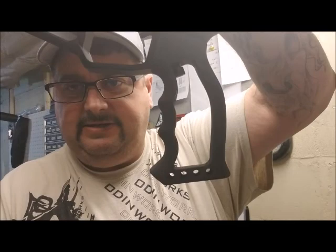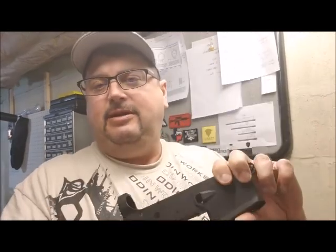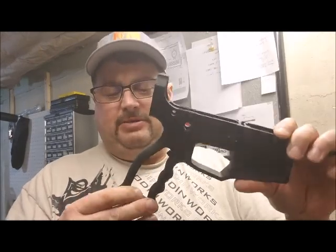Pretty nice, easy to go on, very smooth. If you get some 800-grit sandpaper and get it wet, you can smooth this out, get rid of all the 3D markings, and make this as smooth as any other plastic mil-spec part. It's very light and very durable — you're not going to break it.